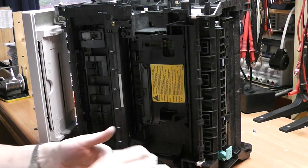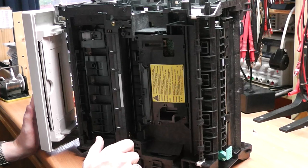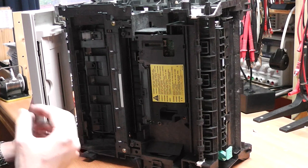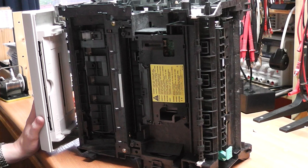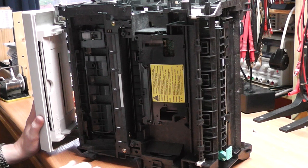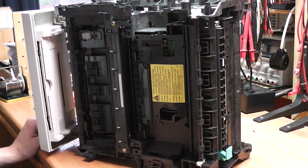How laser units usually work in laser printers: they have a stationary laser which produces a beam. The beam hits a rotating mirror. The mirror is connected to a BLDC motor or something like that. And this then reflects the laser beam to each scan line of the page. We're going to take that apart later on in detail and take a closer look. I'm just trying to get more stuff out so we can later take a detailed look at everything.